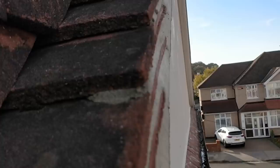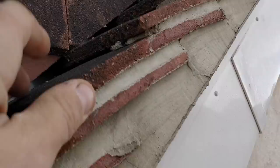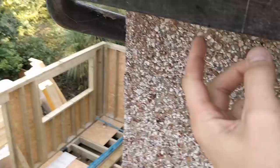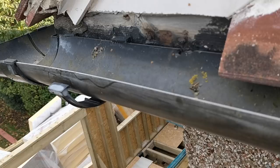I want my roof to continue from this one here - I'll take all the half tiles off and put full length tiles on. I want to build the roof at the same pitch up to a certain point and then have it come down inside. It's pretty tricky to explain and very dangerous to show, so I won't be faffing around much more up here. What I'm going to do now is cut off some of this broken, manky old guttering so I can find where the head plates can sit.